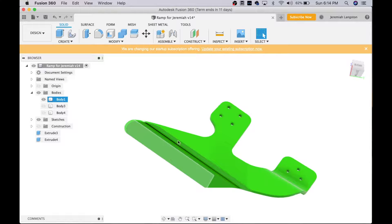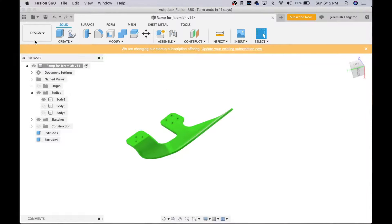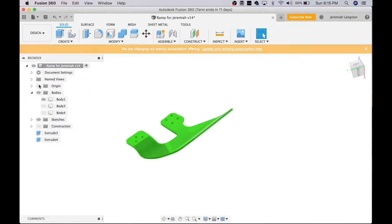This is flat, this flange down here is also flat, and then this little ramp here is bent. This represents the tabletop of my milling machine — I drilled four holes in it and those are going to be locating pin holes for the starting material. This is a two-sided machining job. What I'm going to do is locate the starting block using those holes, then mill into it, and then I can turn it around and flip it over without relocating the part or having to reset the machine.